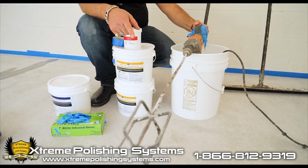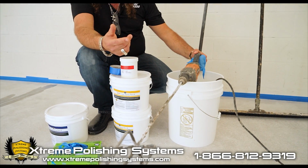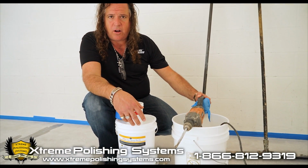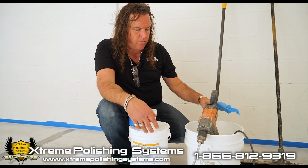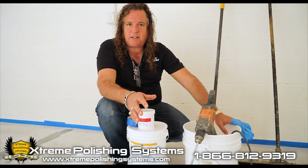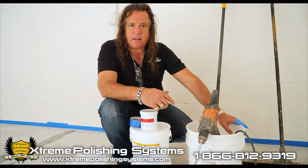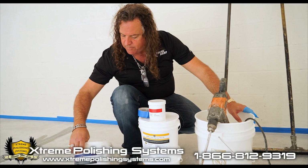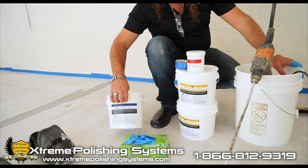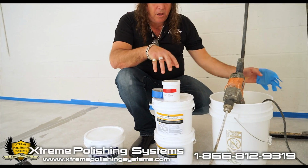There's our mixing paddle. This one's been used before. After you use them, always make sure you clean them off with denatured alcohol or acetone as a cleaning solvent, okay? You want to have clean buckets. For every kit that you buy from us, you want to go out and get a clean bucket for each time you're doing a mixing, okay? What we've done is we've labeled our Part A and Part B epoxy with different colors on them so you don't mess them up, okay?